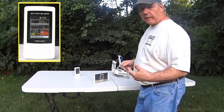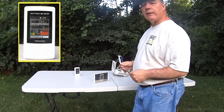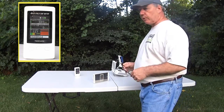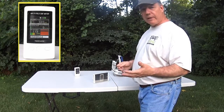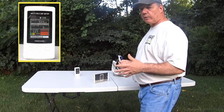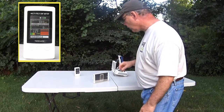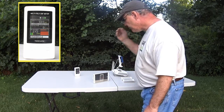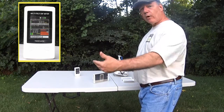By any measure you're much higher with that reflector on there — a big increase in the RF signal being passed downfield towards your drone. It does two things: it guarantees the strongest possible signal at distance, and when flying in close quarters with interference from Wi-Fi or power cables, that extra power helps overcome those signals so you won't lose video or connection. Just to show this isn't chicanery — I'll slide it off, and we drop back down to 2.43, 2.39, 2.55.